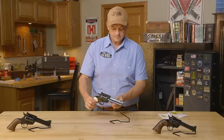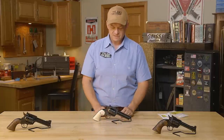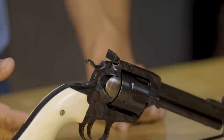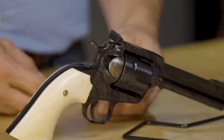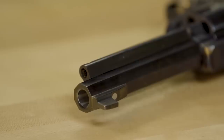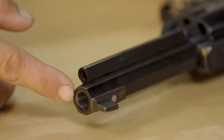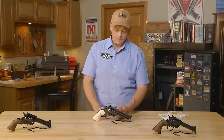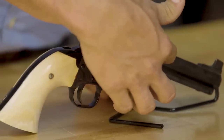For the rear sight we went with a Hamilton Bowen rear — it just had to have this good solid steel rear sight. After we installed a Bisley hammer, we kept the factory trigger and went with one of our full house action jobs and accuracy package. In our accuracy package we did a barrel crown — with the custom barrel it came standard anyway — and we also set the end-shake.